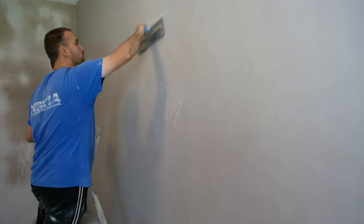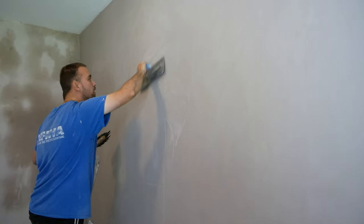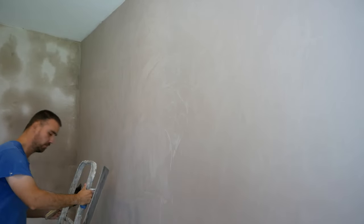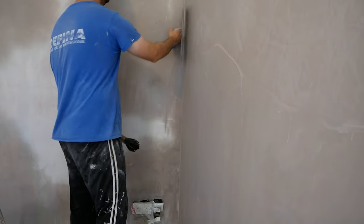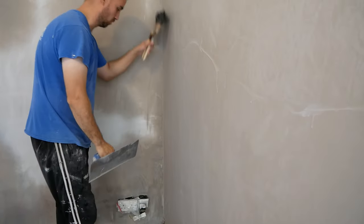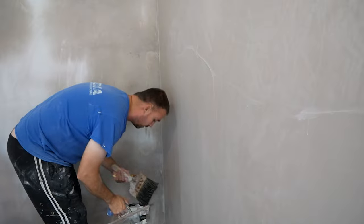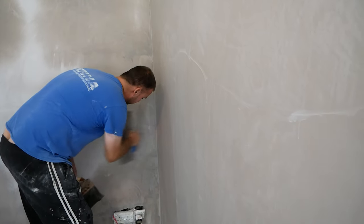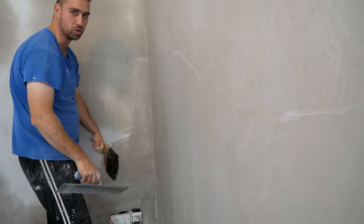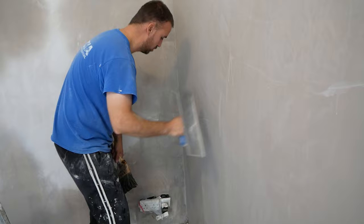You can see these lines here guys — I'm bringing them down the wall. You just don't want to leave fat marks on the wall because they can leave horrible little lines that won't paint out. You want to trowel them out — don't leave too much water on the wall as it can tear at this stage. If you're slower getting along the top but you come back to do the bottom, those wee bits can tear. Also, if you're too early the wall can tear and rip, and if you have dirty water that can also cause it to happen.